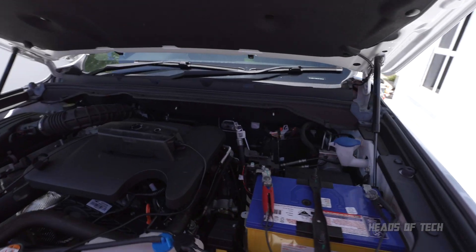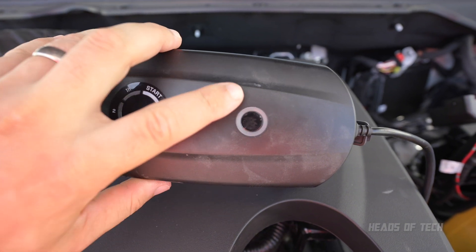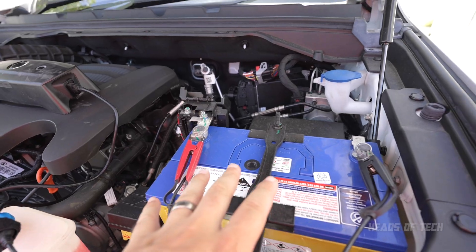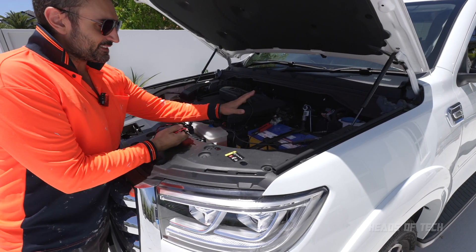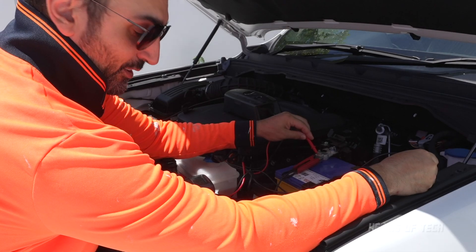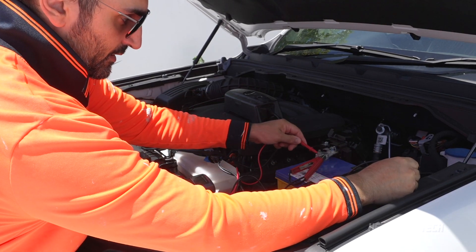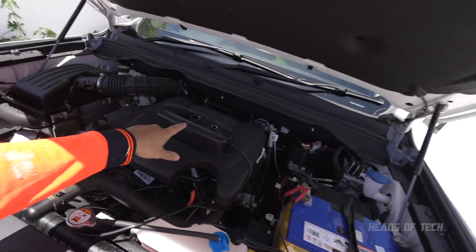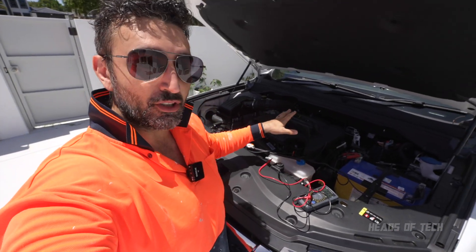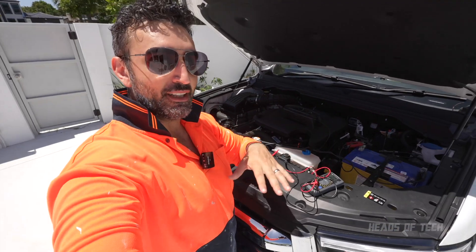It's now been a couple of hours. You can see the CS3 is out of battery and it's just charging up using the solar panel — that's what that blinking light is. The car battery is still charging. What I want to check now is whether it's actually still charging the main car battery while the solar panel charges the CS3. I've got my multimeter here and the voltage right now is 13 volts, and if I take off the clamps the voltage is 12.9 volts. So there is charge being pushed from the solar panel through the CS3 straight onto the battery.